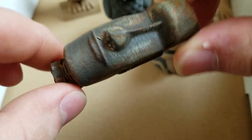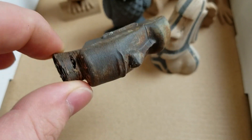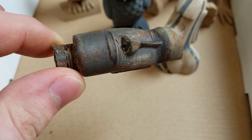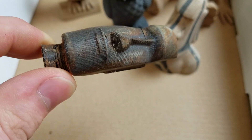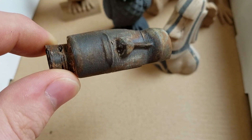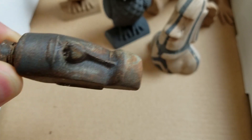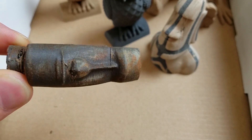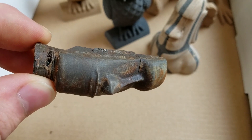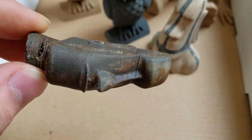This is after rusting overnight. I didn't rust it with just salt water — I used a mixture that's 50-50 hydrogen peroxide and vinegar. I used red wine vinegar; usually they say to use white vinegar but I didn't have any. Then I also added some salt water, so it's roughly one-third hydrogen peroxide, one-third vinegar, one-third water, and you keep adding salt until the solution is saturated. I got a paper towel, soaked it, and wet the entire outer surface. Then I soaked the whole paper towel and wrapped it around the part overnight, and wrapped that entire thing in tinfoil so it wouldn't dry out.